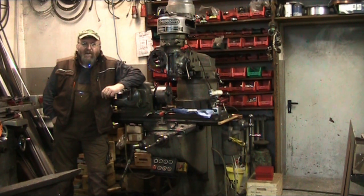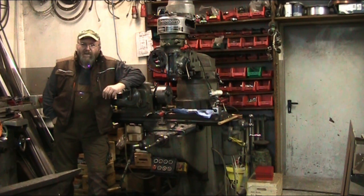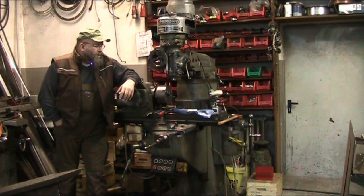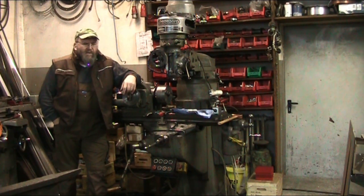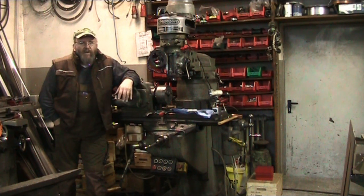The reverse clutch is still okay in it, but I can't run it right now and demonstrate how this part is going to work, but the principle's there. And for any of you wanting to copy this, all you need is a mill of some sort. And there's different ways to index your part in a vise if you don't have a dividing head. There's other guys out there that have pretty good instruction on how to do that with the help of a V-block. I can't recall off the top of my head who all does it. I think it was Mr. Pete and then somebody else. So if you want to check that out, by all means, go ahead. But if you have access to a mill with a dividing head, this is how you're going to do it.